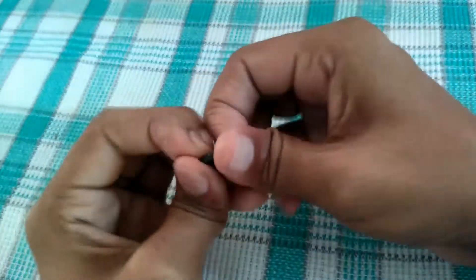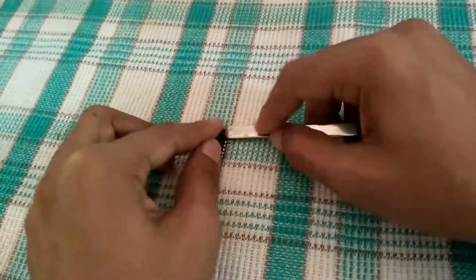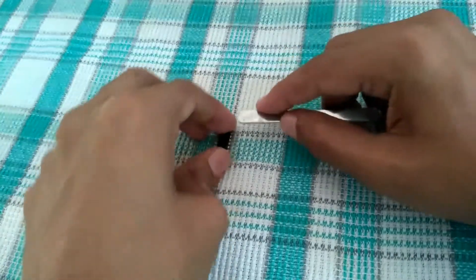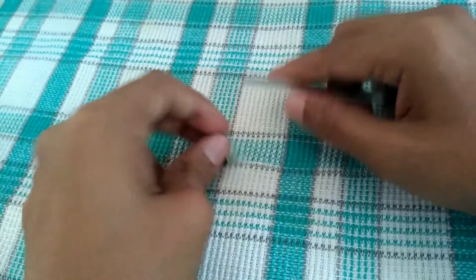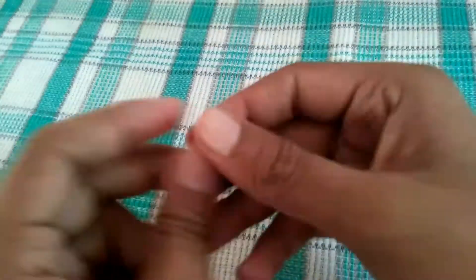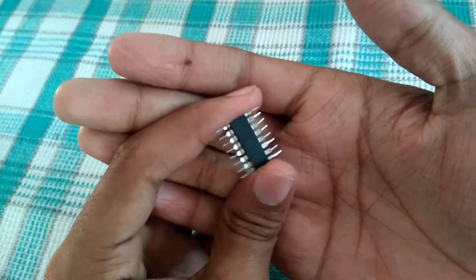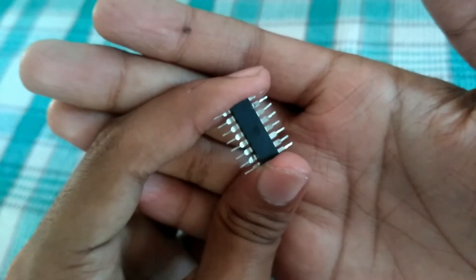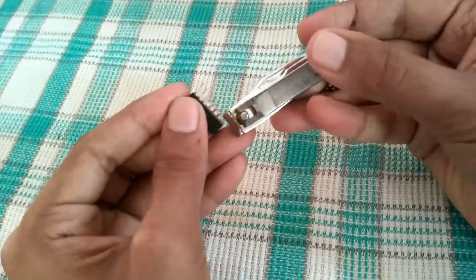Since most of the top part of the PCB is covered with copper for detailing, there's no place left for through-hole ICs, and I don't have SMD versions of these ICs. Therefore, I came up with SMD-THT hybrid footprints. You will need to bend the IC legs with the help of any flat tool you have around, then cut the excess parts. In this way the IC will fit perfectly on the PCB.